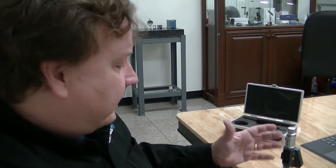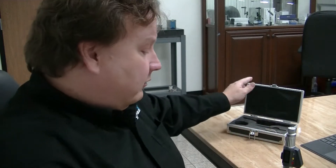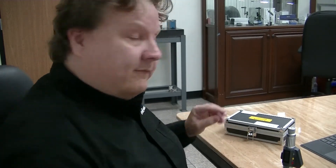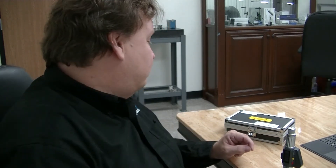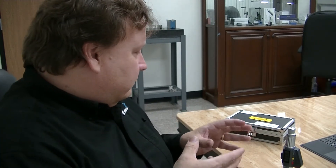Okay, and now you've calibrated the instrument, and you can use it to measure any hole from 0.472 inches to 0.630 inches — and that's just for this one. They actually make the three-point internal micrometers all the way from a quarter inch up to four inches in diameter, which is the same as about six millimeters up to 101 millimeters or so.